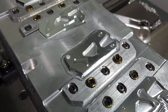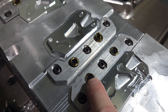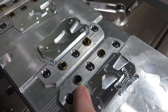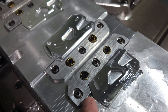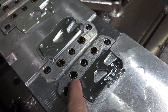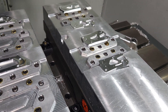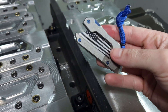It's just mini soft jaws but on a pallet. Let me show you. So this is one of the Piranha fixtures. As you can see, there's the cam. And I've got some shim stock in there because I actually made these holes a little bit too big, and sometimes depending on the laser set it's not tight enough in there. And sometimes, you know, this is aluminum so it's soft and the steel is going to push on that. And if you're not familiar with the Piranha, this is what it looks like. This is an all-titanium one.